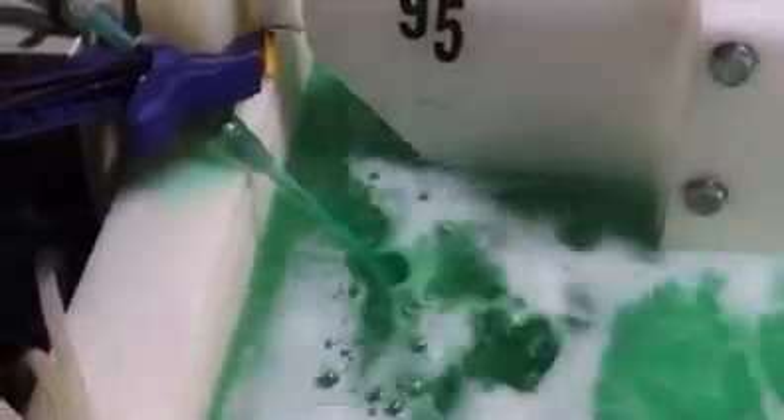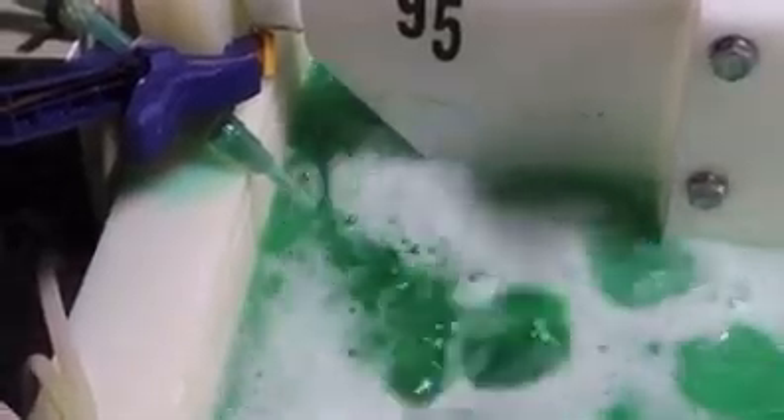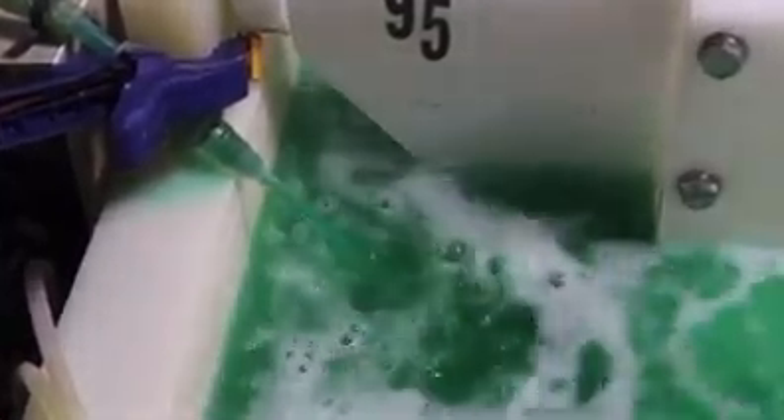This third option helps keep the bath at an optimal concentration of all chemical ingredients to ensure top performance and stability. The flow rate of the pump can be adjusted depending on the size and load of parts being plated.